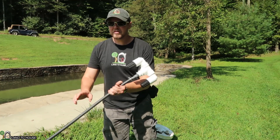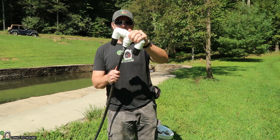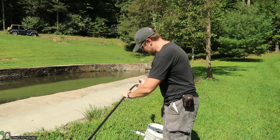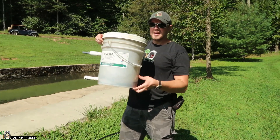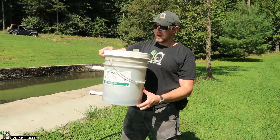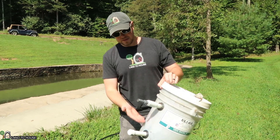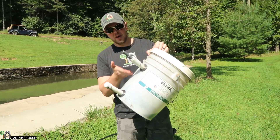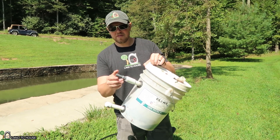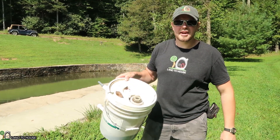For step one, I'm going to run about a hundred foot of poly pipe with this reverse siphon intake on it. From the other end of this pipe, I'm going to install this bucket intake. It's quite dirty, I'm going to have to clean it out. The concept is water comes in the top from this poly pipe, fills up, and has this much room of silt catchment. And then this is where the drive pipe of the ram pump will come out. So let's go ahead and get these two items set up first.